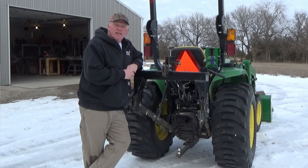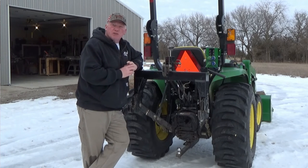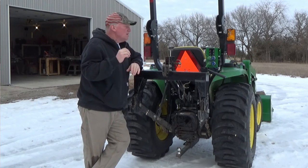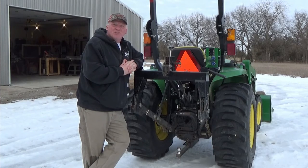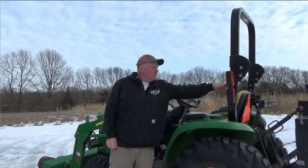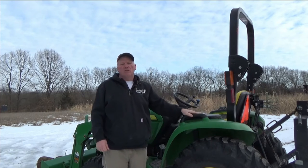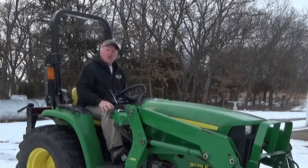Last but not least you've got your PTO with the guard down here — 540 PTO — and it's electronic engagement. Compared to my 1951 Ferguson, the nice thing is if you've got the mower on it, the PTO keeps going whether you're going forward or back. You don't have to wait and shut down your mower. The tractor also has a roll bar, and you can pull the pins and lower it down if you get into trees. I like to keep it up all the time because you never know. It also has a full light package — turning signals and four-way flashers.